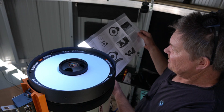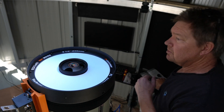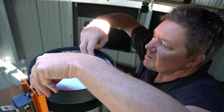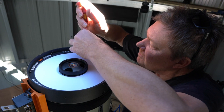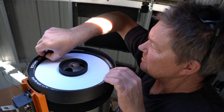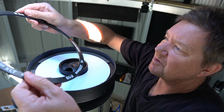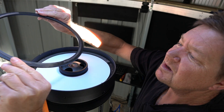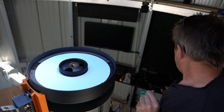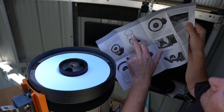Carefully remove the retaining ring from the telescope, also removing the gasket material ring underneath the plastic retaining ring. These screws are quite long. Must be a notch somewhere — get that past the notches. You just have to kind of slightly bend it out of shape just to get it out. Now that gasket has come off with this — it's stuck to the back of that. So next step is to also take off this gasket ring here.